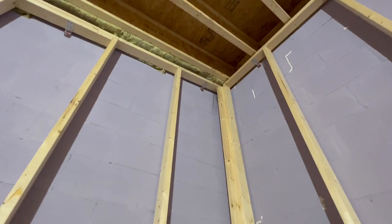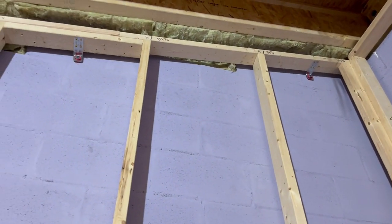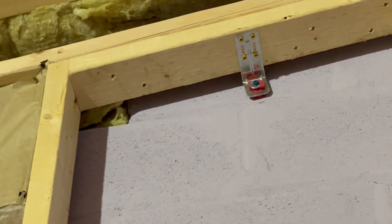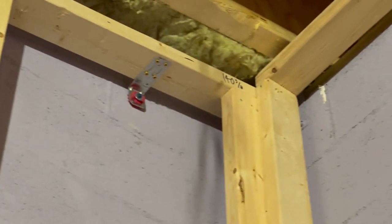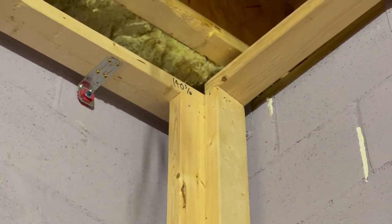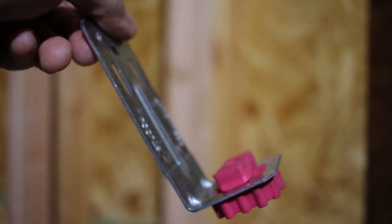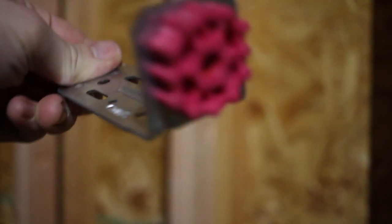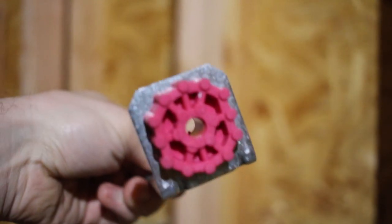The way he attached his studs to the ceiling rafters is through the same method we used in my studio — special IB3 clips that you can get at a soundproofing wholesaler like thesoundproofingcompany.com. These work great and are super easy to install. One side goes into the concrete blocks and the other side attaches to your inside wall. These clips are specifically made to reduce the amount of sound transferring from the outside wall to the inside while also holding your walls up against the system.